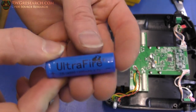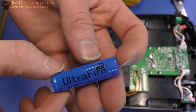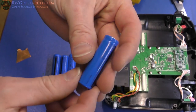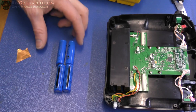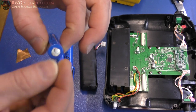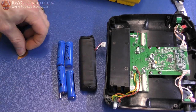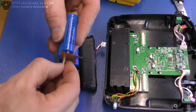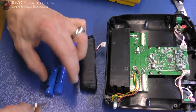These are Ultrafire TR-14500s, 1200 mAh, 3.7 volts — lithium-ion batteries. I have four of them. These are smaller than an 18650, and 1200 mAh is not as much as I really want. So what I did is I put two in parallel and two in series. I did something very strange for making a pack. I took these little magnets, put them on here, then took a piece of copper and put the copper in between the magnets — that made my connection. I did the same thing on the other end and in the middle.